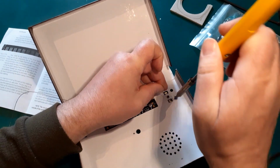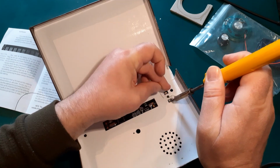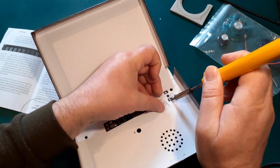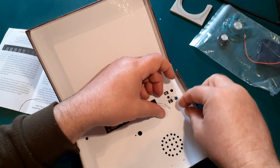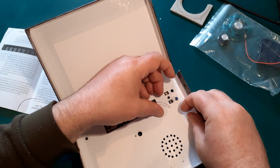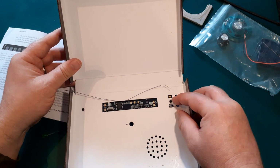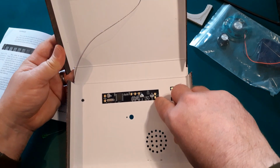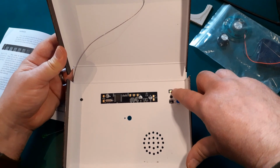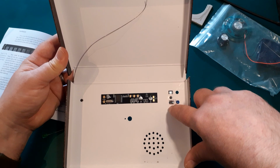So let's apply some heat on the pad. Plenty of solder, just oodles of solder, probably burning the cardboard. And then let go. And I think, to be fair, hats off to Haynes. That did not go down. That was not too bad. I think it helps. The quality of the pads, the copper, doesn't quite look coppery, it will be copper, is very good. It's very clean pads, no oxidation, so things are soldering up really well and easily.